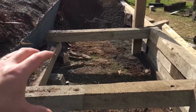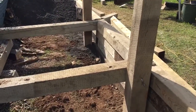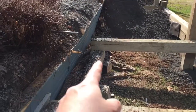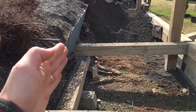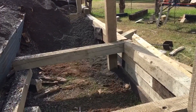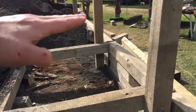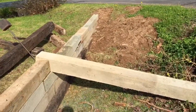You can see he put dog legs in here, which held somewhat, but he didn't put enough. Dog legs anchor the wall into the ground — this entire section of ground would have to push out to move the wall. As long as the ground further back is more stable, it adds strength. One important note: don't allow your new dog leg and your old one to be touching, because that contact will transfer pressure and cause failure. We're going to do two layers of dog legs.